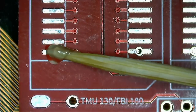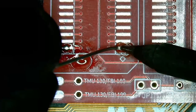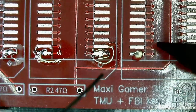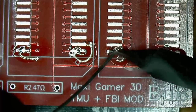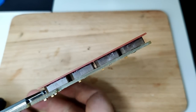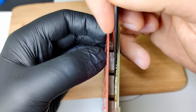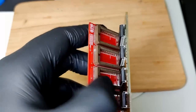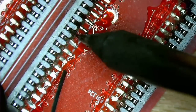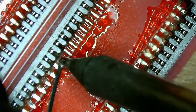We can start soldering the pins through the holes the day after. A small amount of flux and solder should be enough to attach the pins on the other side to their corresponding pads. All this work is required to keep the sockets underneath in position. I keep both boards clipped to the Voodoo card throughout the entire process, which ensures we will end up with two boards that will perfectly fit over the memory chips of this card. After soldering the 16 pins, we can carefully remove the boards — if you rip them off with a lot of force, you may end up pulling pins out of the socket. I used a plastic tool to get between the PCB and the socket frame, which makes this process a lot easier. With both boards removed, we can solder the remaining pins of the sockets. With an open socket like this and no plastic in the way, soldering becomes a very enjoyable task.